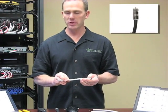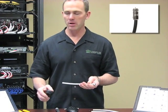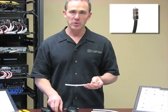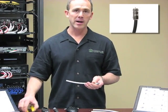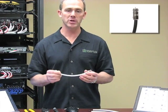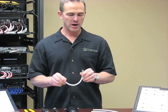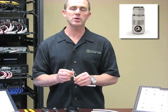With typical F-Connectors on the market, you'd have a technician with a $100 crimp tool and a $30 strip tool. In this case, with the Planet Waves screwdriver, our single-step strip tool, and a good pair of coax cutters — sharp ones so they don't bend the tip — you're good to go. The unique thing about our F-Connectors is it's a time-saver and money-saver, and also, like any other Planet Waves connector, the ends are reusable.